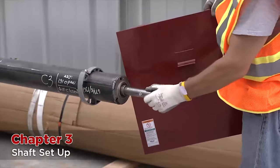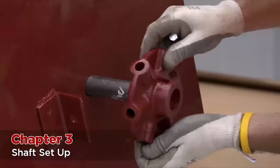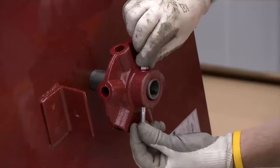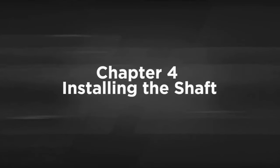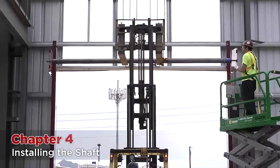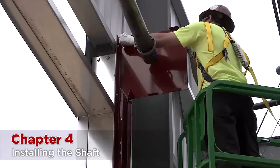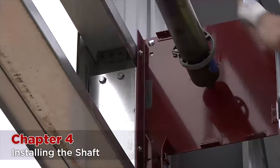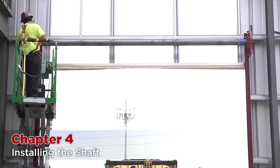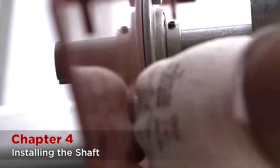The other side is the adjuster side. Put on the bracket plate followed by the adjuster wheel. Secure to hold with the bolt. Lift the barrel assembly into position so that the brackets can be mounted to the guides. Bolt the brackets to the guides starting with the tension side. The bracket should be fastened to the inside of the guides. After the brackets are fastened, make sure that the shaft is centered between the brackets and lock down the set screws on the drive side bearing.